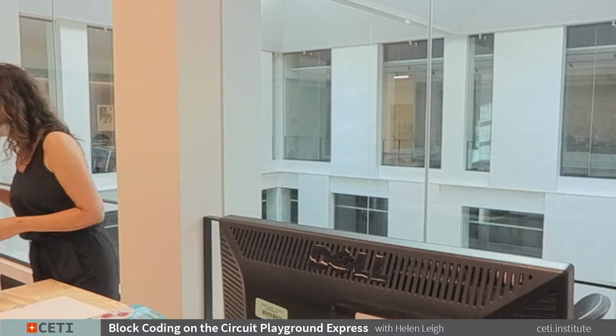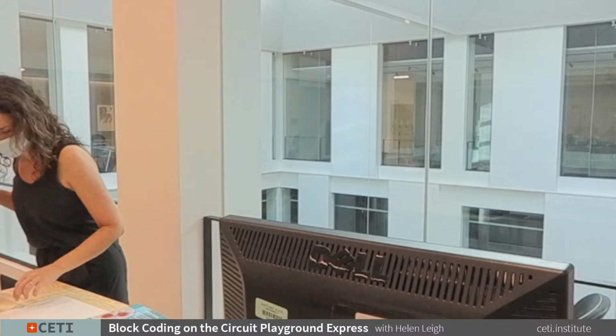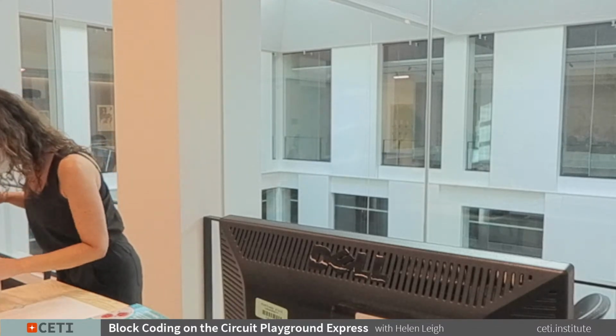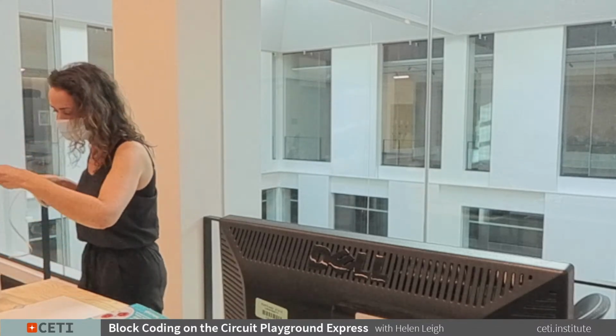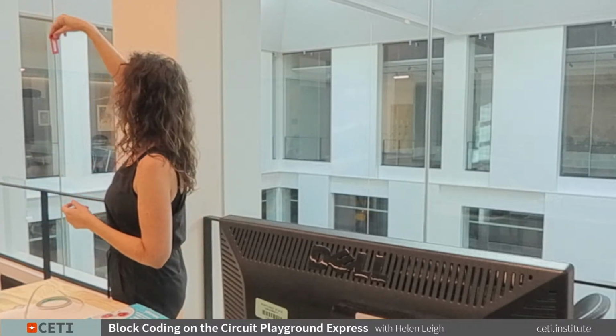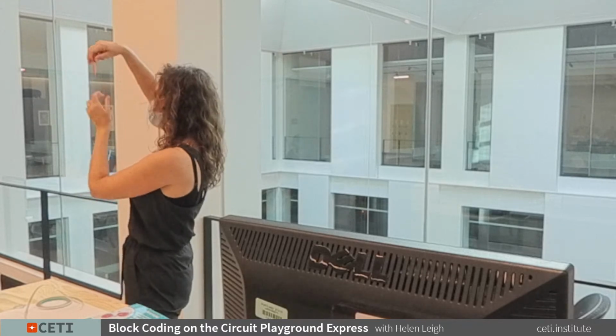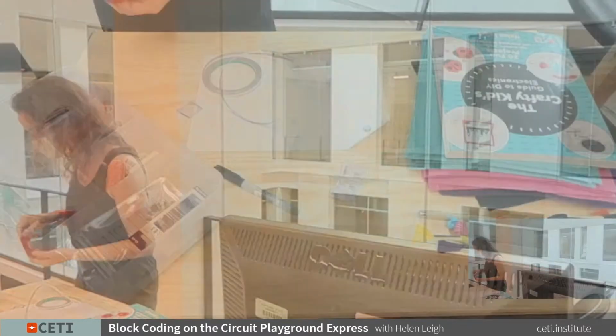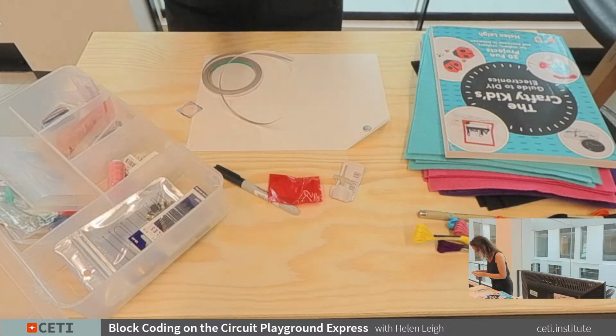These are the only LEDs, the neopixel ones. Oh, okay, I can use the sequins then. That's fine. Yeah, I couldn't find any anywhere. That's fine. Okay. All right, well, if you get this red bag as well, it says Adafruit LED sequins on the back. And I think they've got a 3-volt forward voltage, so we should be okay.